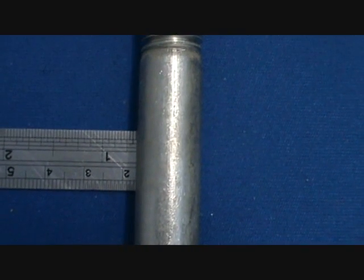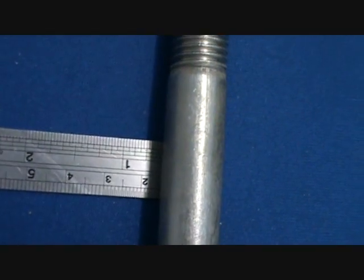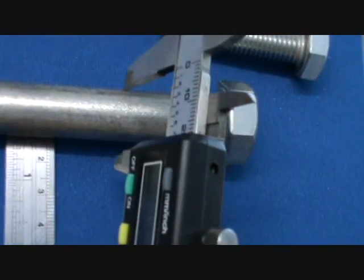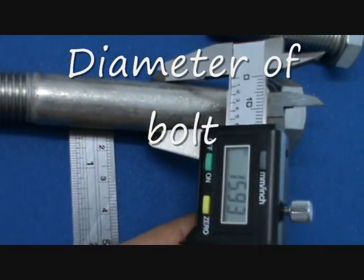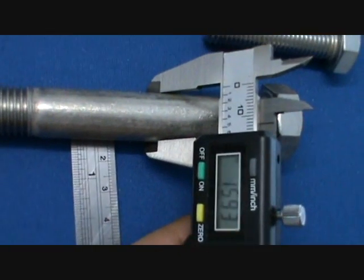Roll the bolt back until you can't see that side. So this little guy is 16mm. And if you're fortunate enough to have a set of vernier calipers, it's a lot easier — 15.92mm. The reading is just a tiny bit smaller than the actual description in the books or on the box.